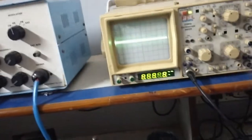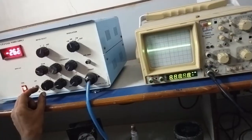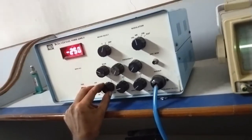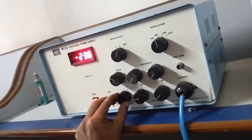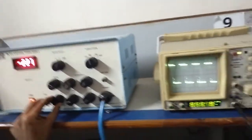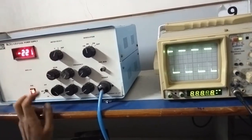To observe the square wave amplitude on the CRO, slowly vary the repeller knob in the anti-clockwise direction and observe the square wave on the CRO. Set the distortionless maximum square wave.